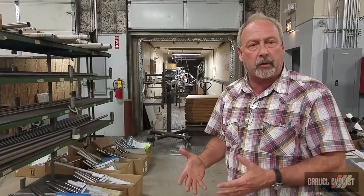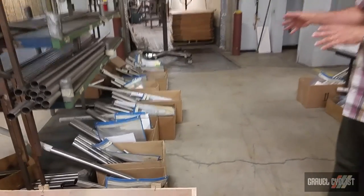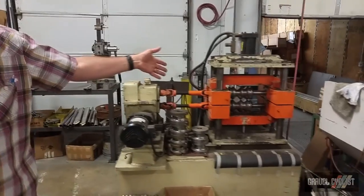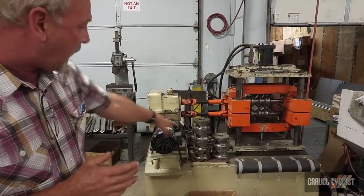Now we're getting ready to talk about the frame. It all starts for us with job packets that define what model we're going to be making, its size, and how many of them. As you can see on both sides of me in our very sophisticated storage bins, the job packets and the base tubes have been cut for whatever it is we're going to be building. After the tube set's been cut, the next thing is all the forming, cold working, and shaping. To your left here you'll see some of our roll forming — that's where some of the shapes are created. Those rolls spin, pull the tube together, and form it into whatever shape, whatever die set we've got in there.